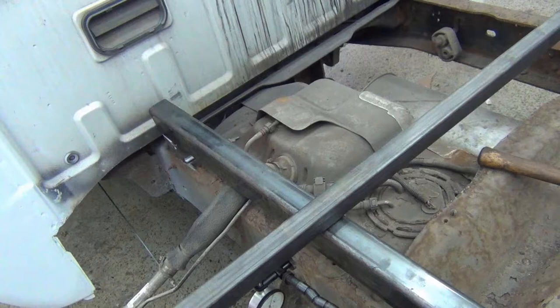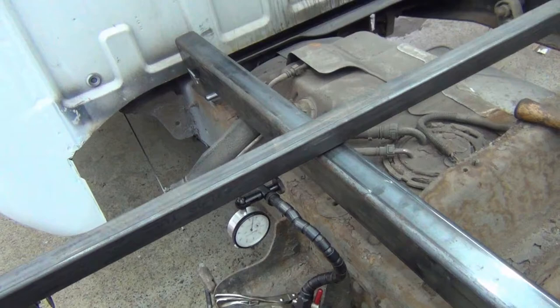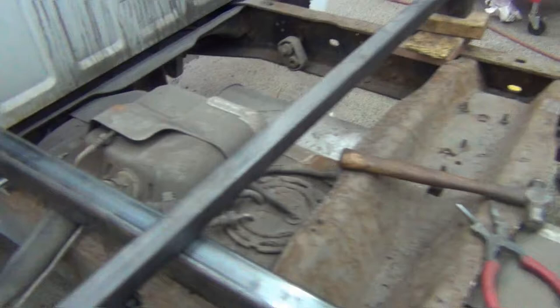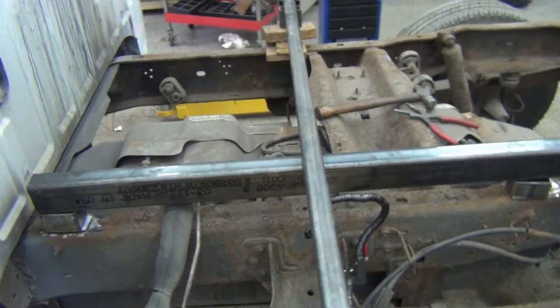So I set up a measurement device and figured we would put a dowel on it, and I'd simulate a point load with no bolts holding this in, just sitting here the way it is. These are just sitting here. And I would stand on it and simulate 225 pounds if I was right here, which is probably about the most point load it would ever see. I'd measure the deflection, so I could post those pictures.